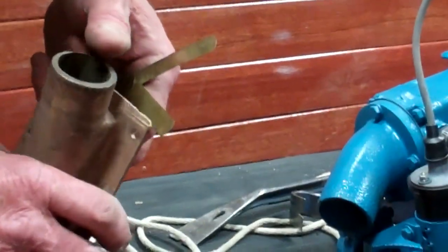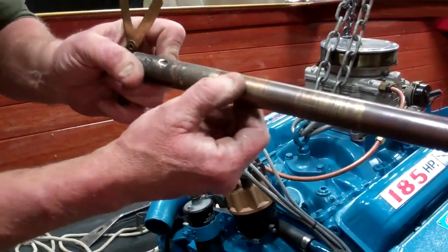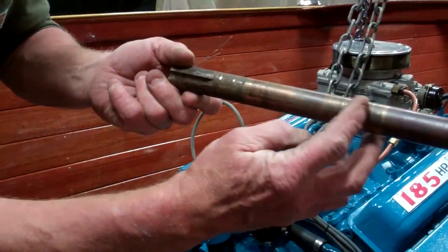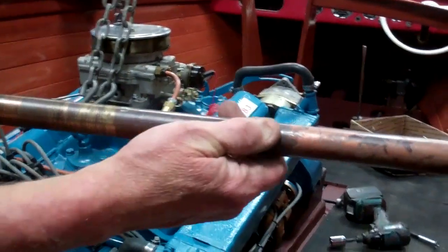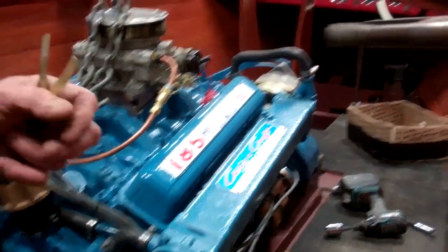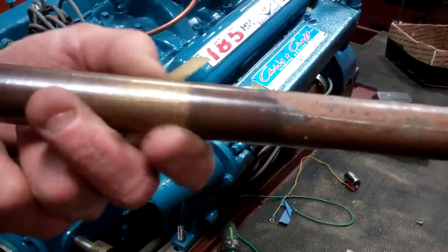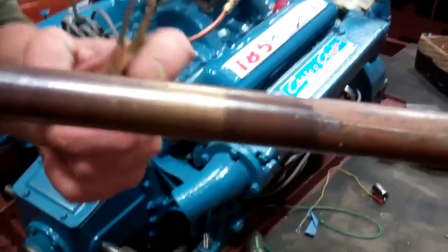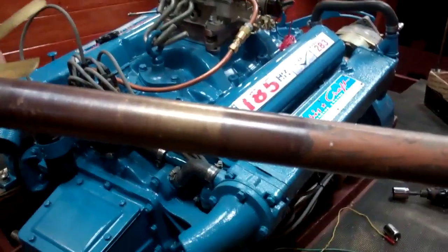RJ's going to bring the old shaft over and present the wear patterns. It was definitely hitting the shaft log here in the hole, hitting right through here — this is worn quite a bit, it's got a groove right in it. There are grooves in this section, and then on the other end where it was in the rubber in the strut, it was twisted sideways, so there's pressure in this area where you can see it's worn to square lines.